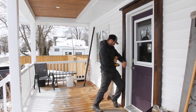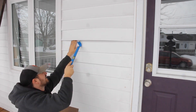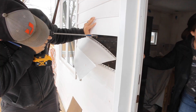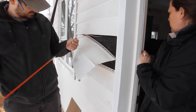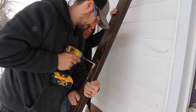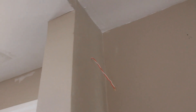Now it's time for the low voltage wires. We are installing the doorbell onto our existing door trim. To do this we had to take off some of the vinyl siding so we could drill a hole straight into the small wall in the foyer. We then ran the wire up from the basement, pulled it through the wall, and drilled a hole in the siding and reinstalled it. We drilled a hole through the wooden door trim where the doorbell will be located. Since we're installing a chime as well, we ran another wire up from the basement while the wall was open.